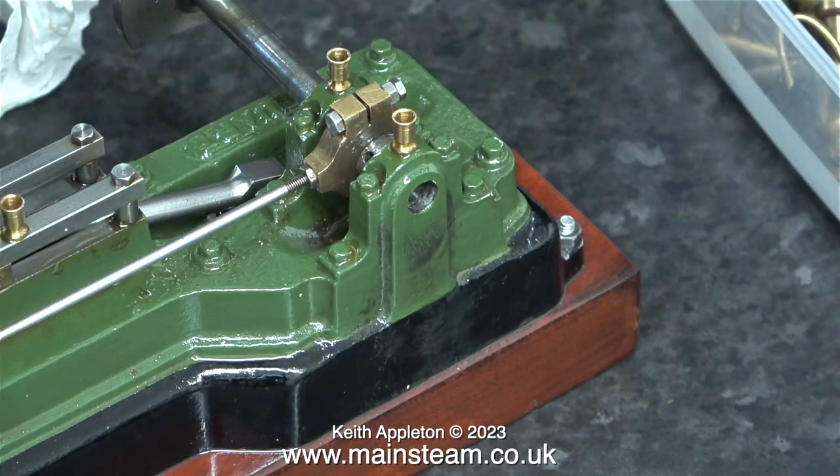The next part of the job is to slacken off the crank pin. Because the crank pin is a normal right-hand thread threaded into the crank web, the flywheel on this S50 engine needs to rotate in a clockwise direction — not the normal anti-clockwise direction — which could loosen the crank pin. The resultant thrashing about of the connecting rod while the engine slowed to a stop could possibly do quite a lot of damage. Because of the burr on the crankshaft, I'm winding it out of the eccentric sheave to remove it. In the end this was very tight in the eccentric sheave, so I used a brass bolt to gently tap the crankshaft through the sheave.